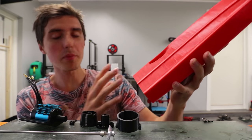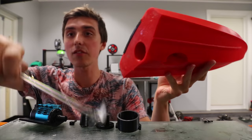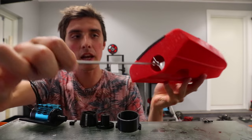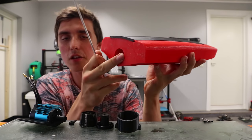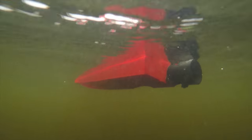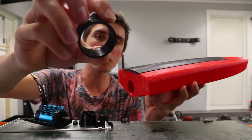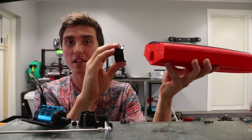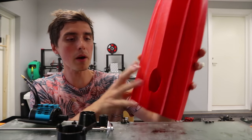What I love about this boat is the fact that it has a jet propulsion system. Rather than having the propeller on the outside, it has a propeller inside the hull spinning and taking water in and pushing it out faster, propelling the boat forward. You have a bracket connected to a servo to modify the angle of the stream to turn the boat left and right.